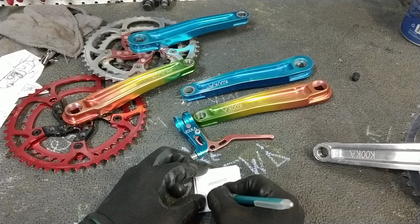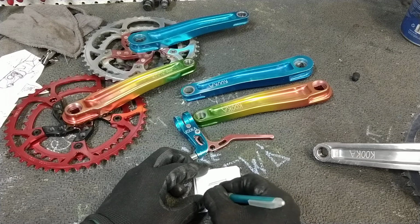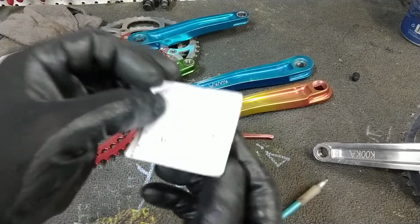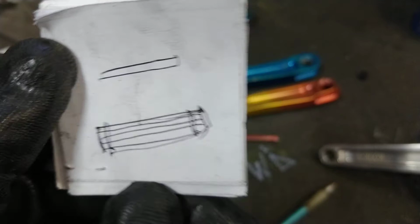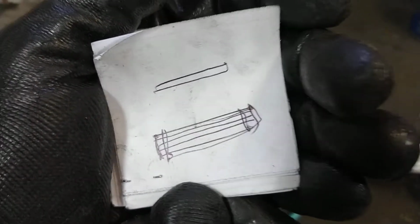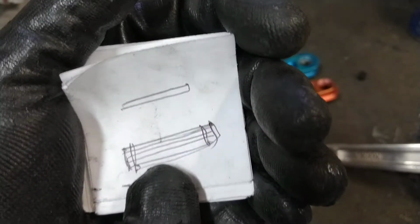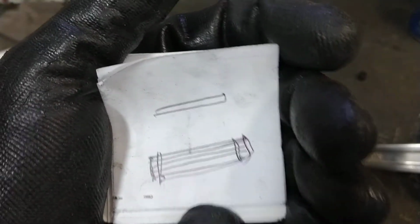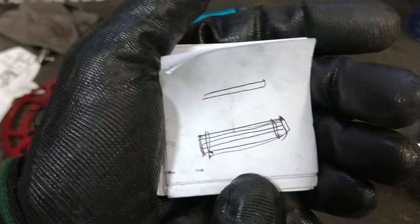You've probably seen these tools where, rather than being one piece of metal, the entire handle, the moving parts, are made from a laminate of riveted together steel or aluminum. There's a lot more surface area. It's a lot stronger way to build a tool. Now, my assumption is that when cheap Father's Day tool companies are building these, they're building them this way so they can use inferior materials and still have them be equally strong to a drop forged or another well-manufactured tool.